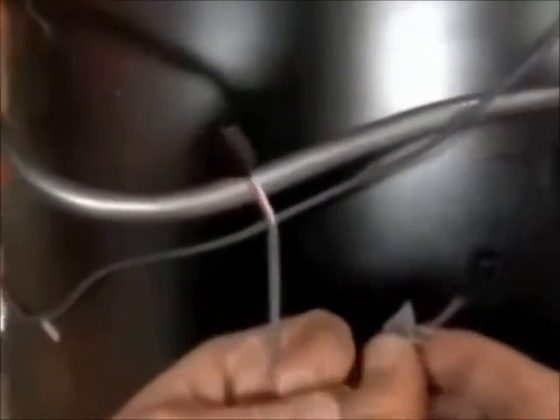We're going to run through these wires and find the two right here — they're also the only two ends that look like this. You'll notice when you're hooking stuff up everything pretty much only fits in one spot. These wires do not matter if you cross them over — just hook them up to the zone valve. You have your main power — that will be basic for your electrician. Now looking at these wires: one looks like a fan so it's going to hook up to the fan. One is a speaker — it has a picture of a speaker on it. You have two light connectors — one with a four pin plug which is your chromatherapy, the multi-lights from the roof, and a two pin which is just your main lights around.